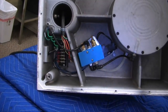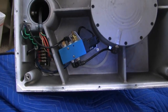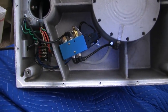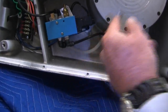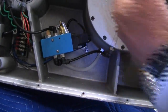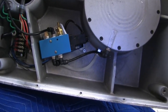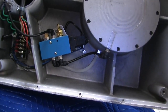What happens over a period of time, and it takes a long time, but I've seen it happen, is that these mufflers got so dirty that they didn't let the air through. The way you test that: if it's not coming up, it's probably this muffler that's clogged. Just unscrew it and see how it works. It's going to be loud, and you get that replaced, but that'll diagnose that's what the problem is. I rarely see it the other way, and I'll get more involved in that in a minute.